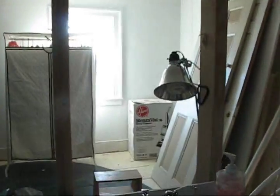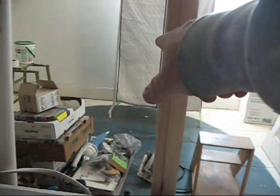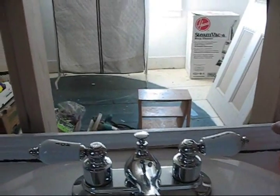Honey Baby says she wants them sitting this high. The problem I see is they slide between the wall studs. If I put them between these two studs, this one is going to sit closer on this side than it is on this side. The way to cure that is I'm going to cut a piece of two-by and run it across here and saw this out, put another two-by beside this. That way the medicine cabinet will sit over to here, which will make it just about right according to my exact measurements on both sides.